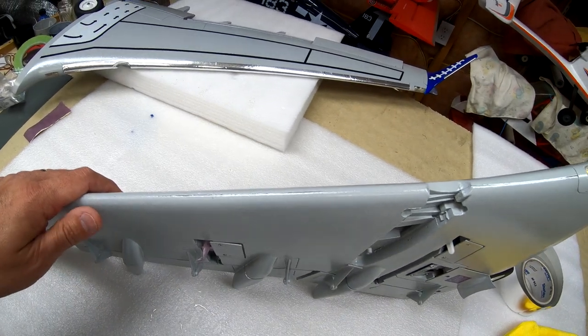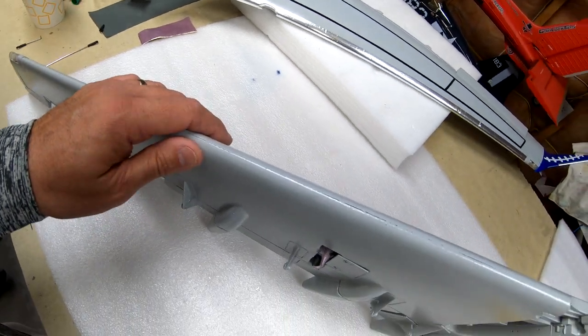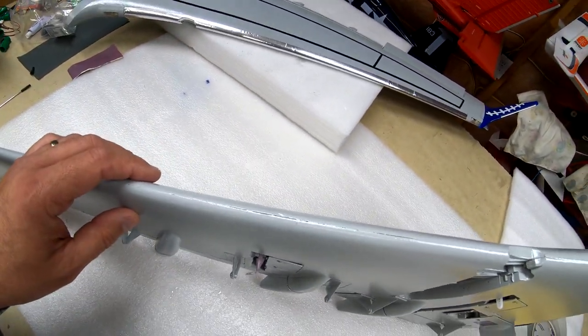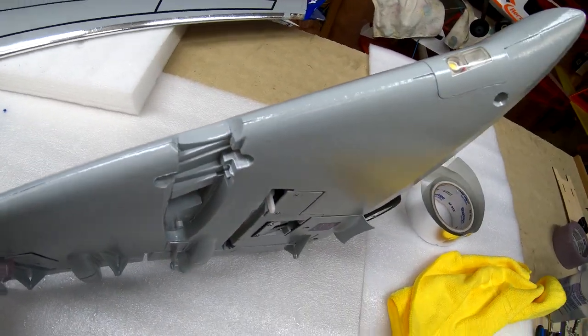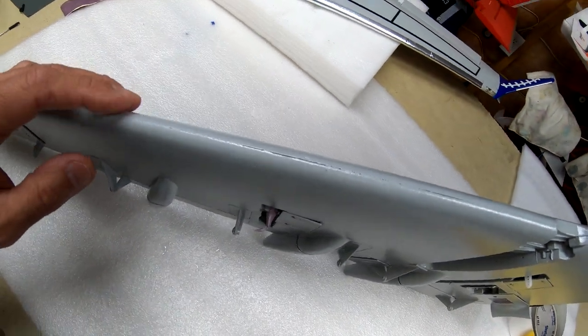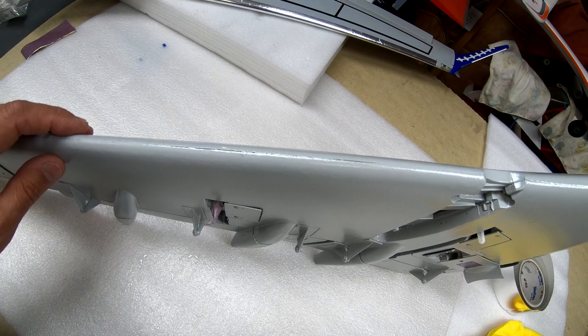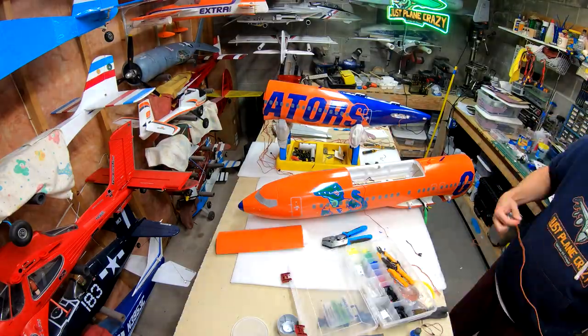So when you're ready to lay it, use a lot of soap and water, and that will help, because the minute it sticks to this, it's going to peel the paint up. And I don't care if you put that stuff in there with a nuclear warhead, that aluminum HVAC tape will rip it right off. So you have to really lube that thing up and be patient and slow and know you don't get a second shot at it.